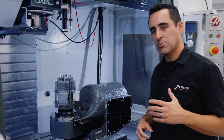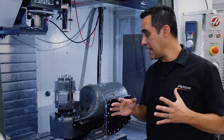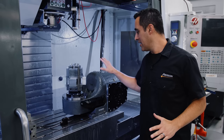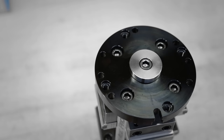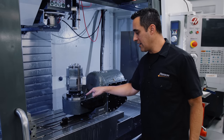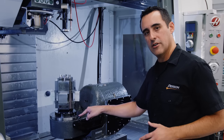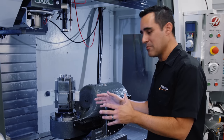Remember that call I got from a customer? The customer called and said, 'Hey, I've been watching your videos. I own a Roto-Vice. I want to buy another one, but I'm thinking of mating it to a Haas TRT-210. Do you know anything about this? Can you give me any feedback?' I had literally never thought about these TRT units. As luck — or almost dumb luck — would have it, our bolt pattern for the flange was identical to the bolt pattern in the face plate of the default TRT-210 platter. You can order these with a zero point system or a T-slot table, but going with the standard, no-additional-cost platter just made it a really simple setup.